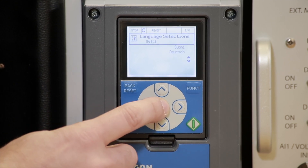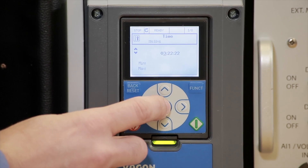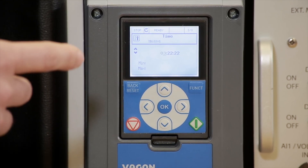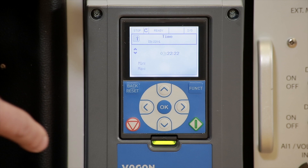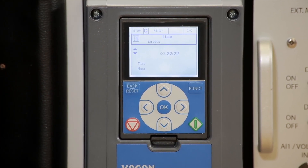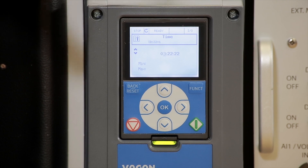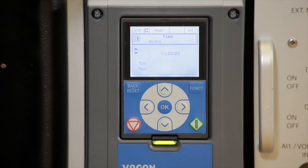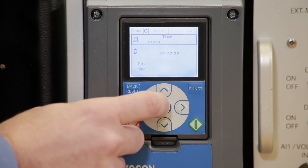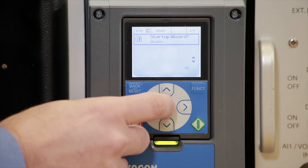The language is English, we're going to click OK. US is fine for daylight savings time. Because we have a battery and a real-time clock inside the drive, we can program the date and time inside the drive. So if anything should happen, or we want to program when the drive runs, we can actually use this. We're going to leave the time and date the way it is — year 2018. You can change it as you see fit.